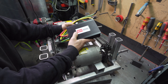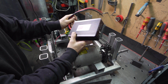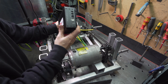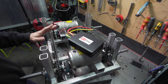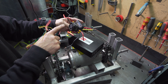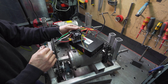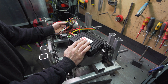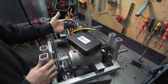A little bit of a setback: last night we tried to power up the speed controller and when we fed our 24-volt power to it, instead of powering on, we ended up with smoke coming out of it. So all the excitement about that nice overpowered controller is out the door. We have a Plan B — two other controllers: a Victor 883 which is 60 amps, and a Talon SRX also rated at 60 amps. They're not matching but they should work. We'll also try to find a way to repair the original or get warranty — though I believe the company no longer exists. Let's just start building the control panel and go from there.